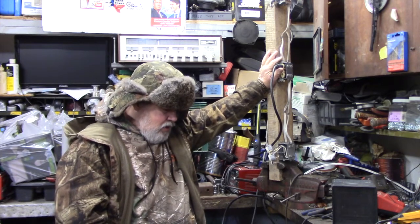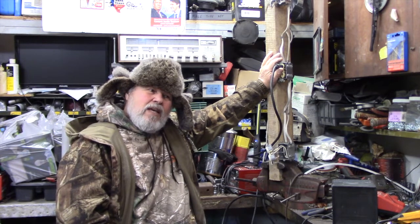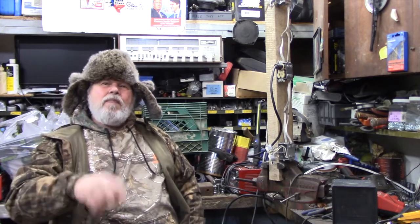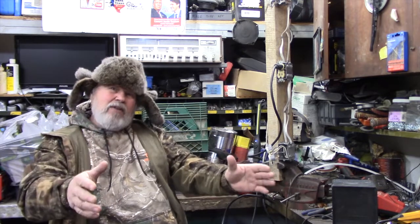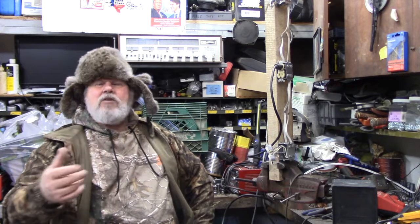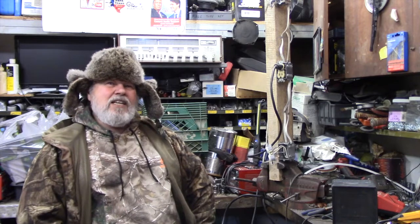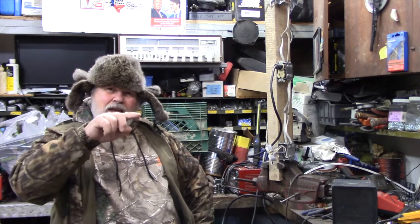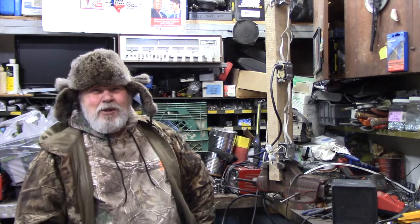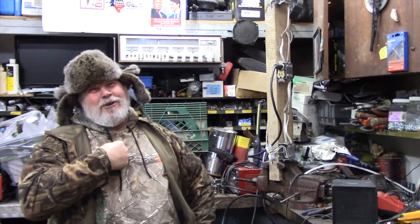There was a discussion on the net, I don't remember who had it, about putting breakers in parallel. Well, I did that before. I was welding in a commercial complex, and there was a panel with 20 amp screw-type breakers, and without taking them out to find a double pole breaker to fit in the panel, I ran pigtails from one breaker on the same polarity, and I was able to weld. With just a 20 amp breaker, it was blowing all the time. But don't do this. I can do it because I'm an electrician, but you guys can't do that.